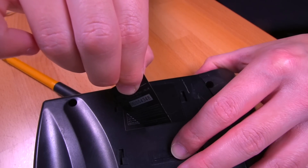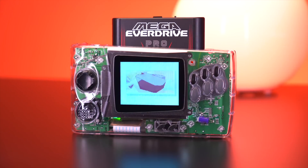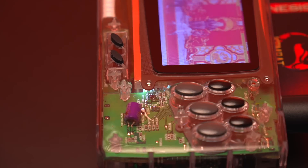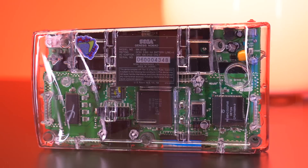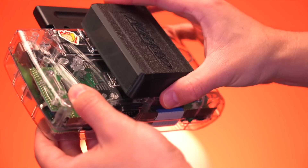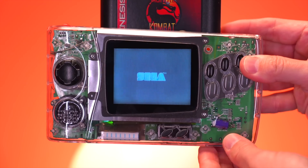To finish things off, I removed the label from the original shell and slapped it onto the new one. And that's it, we're all done. I have to say that I am really amazed with just how well these came together, and honestly the clear shell looks absolutely stunning. Being able to see the internal circuitry really just looks so cool, and I even went so far as to not use the rear RF shielding so we can get a better look at those really beefy integrated chips inside. The before and after is night and day, and thankfully everything works just great. The buttons and D-pad feel good, the power switch slides freely, and the new shell even works perfectly with the LaserBear battery pack — which is also 3D printed. I think it's no surprise at all that these shells are perfectly viable as replacements, and honestly the results, as demonstrated here, can be quite incredible.